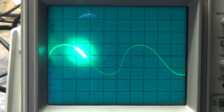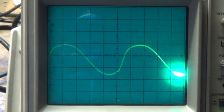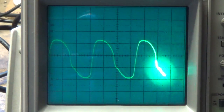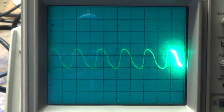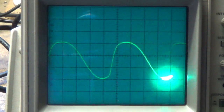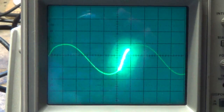Here's an oscilloscope view of the oscillation loop itself. We're at a speed setting of about 1, and as you can see, it's oscillating at a little over 1.5 cycles per second. I'm going to crank the speed control up, and the oscillation rate will increase to about 6 cycles per second. So the oscillation rate of the Fender Deluxe Reverb tremolo is about 1.5 to 6 cycles per second.